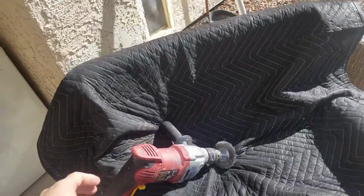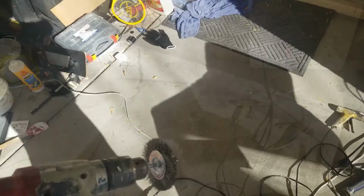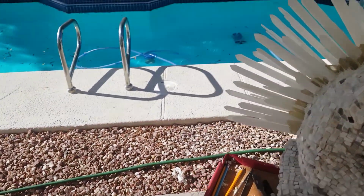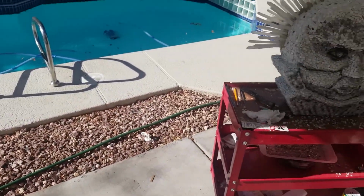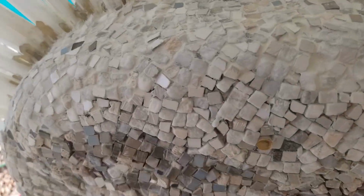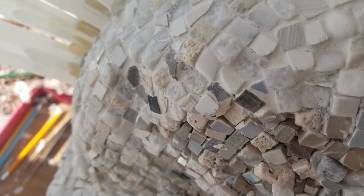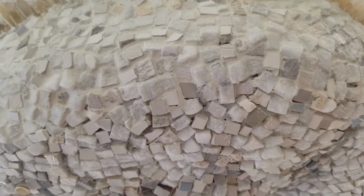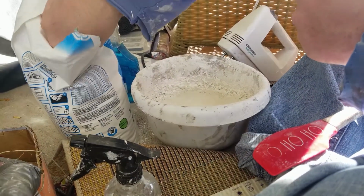So I tried to kind of shore it up here along the edge with a whole bunch of stones. And I used this baby here that I got pretty cheap at Harbor Freight, this sort of wire brush. Maybe you could see that as I go over it, that wire brush knocks off a ton of the material that sort of stuck on top of the stones. It really cleans them up, half polishes them, and then I put in this grout in between the stones. That's what I'm going to do now, mixing up another batch here. So let's go make some grout.